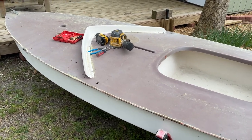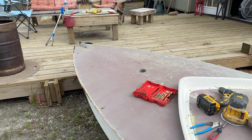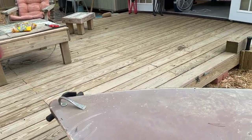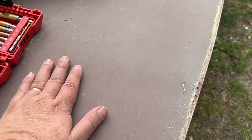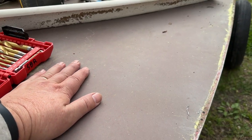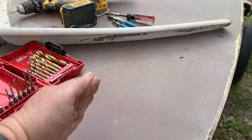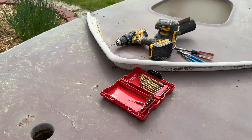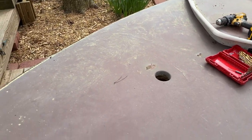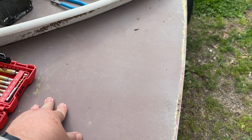We've been there, done that. But I missed a few spots when I went out and bought this boat last year - I probably wouldn't have bought it if I'd taken a better look. Right in here - I don't know if it'll show up - but with very little pressure that thing is moving almost an inch, and there's supposed to be a foam block in there with adhesive foam holding it rigid. It's really bad on this port side; starboard side is about the same. There's another block up in the bow that feels pretty good and firm.